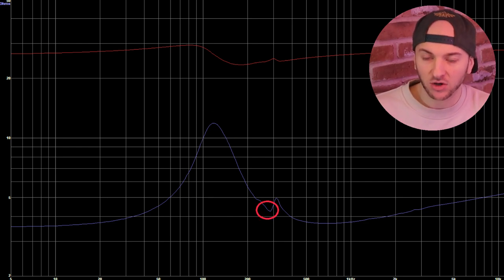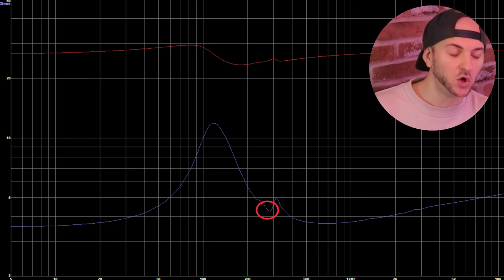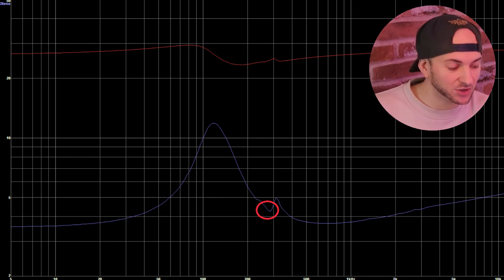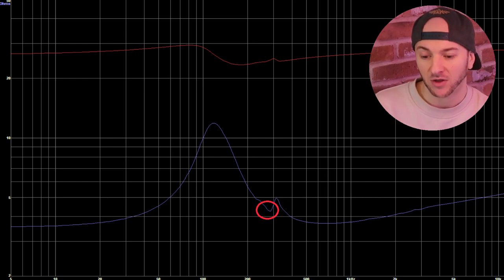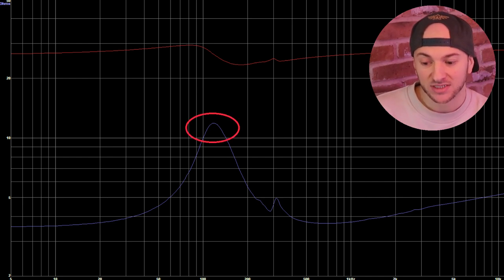Now, this tuning frequency of 283 hertz scales to 47 hertz, so we should do okay on the higher frequencies in our testing. Although the box being so big, I don't know how much control the driver is going to have of the cone. It doesn't seem super happy playing those higher frequencies without some kind of air spring or load behind it. But yeah, the lower stuff, the 25 hertz and the 33, I think is going to be in the bin.